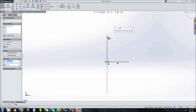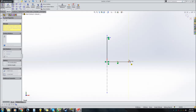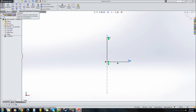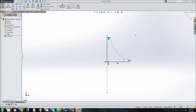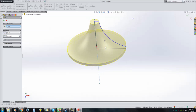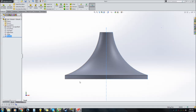I'm going to make the center roughly 7 millimeters, then make an arc there. This is for a super-back compressor wheel — I'll do 4 millimeters here, because on a super-back compressor wheel the base isn't flat, it has a little arc. That's my profile for the center cone. We're going to do a Revolved Boss/Base — select your axis of revolution as the center line and make sure you have a closed profile. There's our center cone.